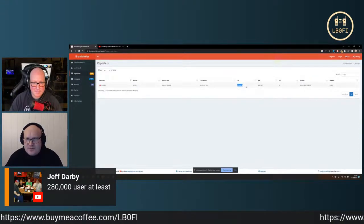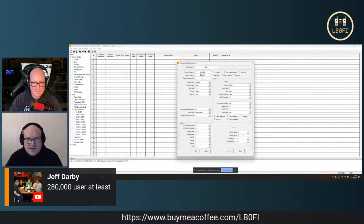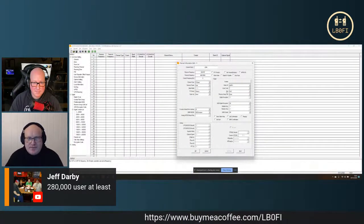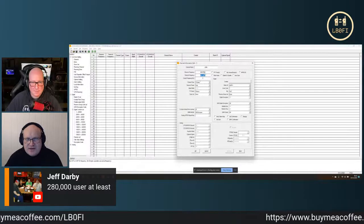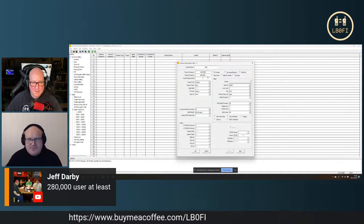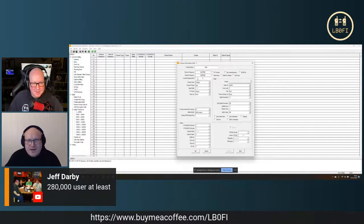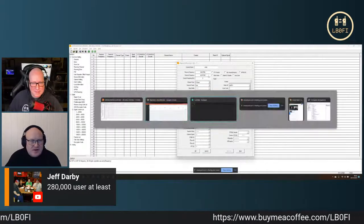So in here, the first thing it asks us for is receive frequency and then transmit. Oops, that's the wrong one. TX for this one. This is, of course, opposite of what it should be. Very interesting fact with these ones is that they require you to fill in all the numbers. So you have to have 5 digits after the point. Otherwise, it doesn't work. And that radio does that when you enter from the keypad as well. It also requires all of the digits. Yeah. So this one, in Norway on UHF, there's a 2 megahertz offset, if I don't remember wrong.